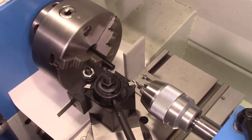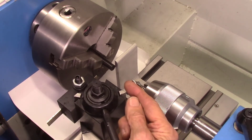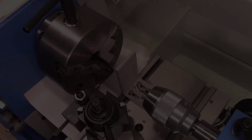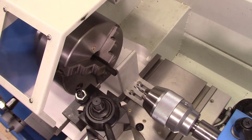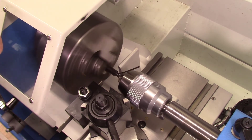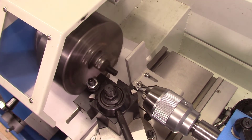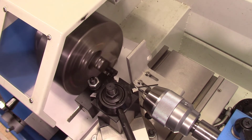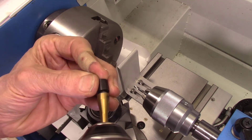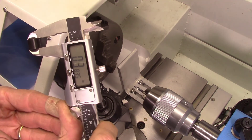Then a final step is to deburr it. So it's actually four steps: number one, setting the length of the spacer; number two, drilling the hole; three, cutting it off; and then the final manual step, deburring the small pieces. Here are the actual steps: first, setting the length with the stop, moving the stop out of the way, drilling the hole through the center of the Delrin rod, pulling the drill back, using the cutoff tool to cut it to the exact length, and finally deburring the two holes in the center of the Delrin spacer. Here's the finished spacer cut to the exact length — .383 inches.